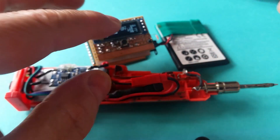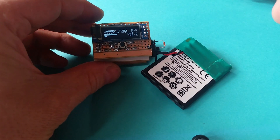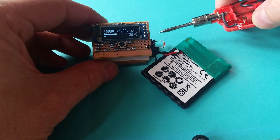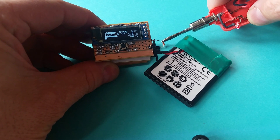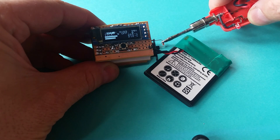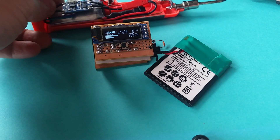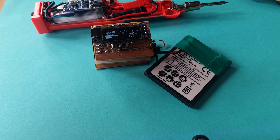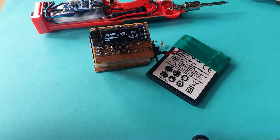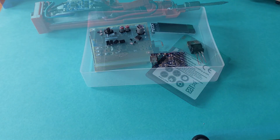If I get a hot soldering iron on top of that without damaging the battery, I'm going to heat it up here and you should see the temperature start to go up. It's a 100k thermistor — the readings start to rise. They're not exact temperatures; I haven't calibrated it yet and I don't have anything to calibrate it with. But I can use that to switch the soldering iron temperature control on and off. I need to do a surface mount version of the board because this board obviously won't fit into the soldering iron as it stands, and I've also got a second soldering iron I want to make a backup unit.